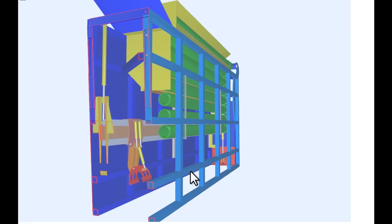It's like a screed. It's like screeding off concrete. You'll screed your stone off to the right grade. You'll lay your pipe at the right grade. You put your top on. You grade it out at the right grade. That's what these up and down cylinders do here. Like I said, they tilt to the angle, and you can over tilt it if you need to.